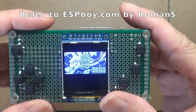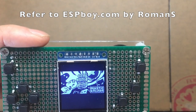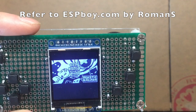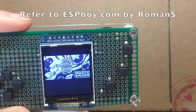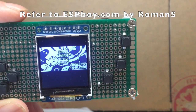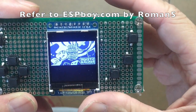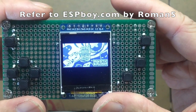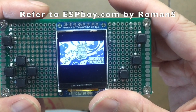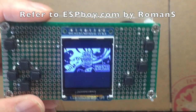You just need to press Reset while holding the button A to activate the Wi-Fi screen menu. The first time to log in, you have to reset, pressing button B to set up your Wi-Fi, SSID and password first, and then you can go ahead to load up your games through the App Store. There's around 36 games currently available. More and more games will be added when the permission from the original game author is obtained.